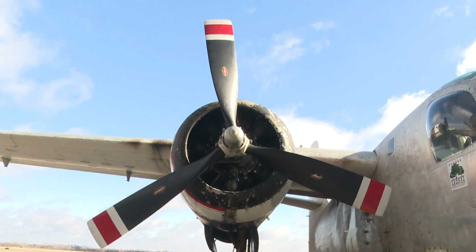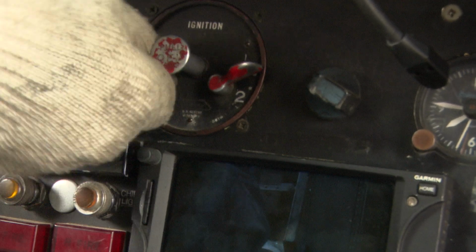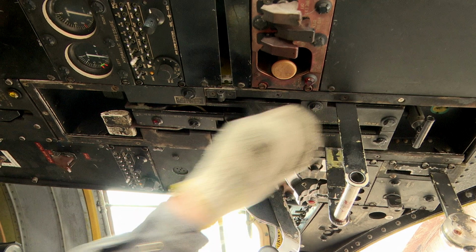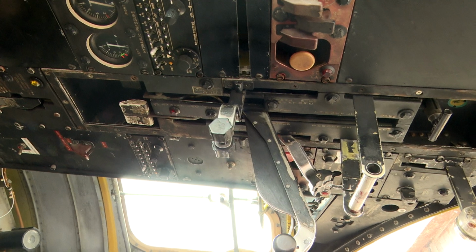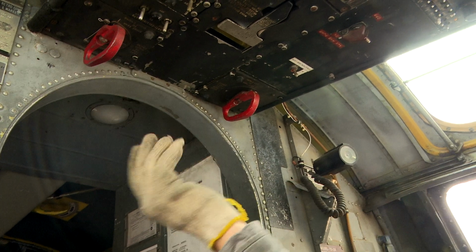There are 3 emergency shutoffs. First, cut off the engines, located on the control panel in front of the seats. Rotate the red levers to the outside and pull the knob in the middle out. Next, pull back the fuel mix levers on the cockpit ceiling. Finally, on the ceiling behind the seats, rotate the red handles so the point faces back to shut off the fuel.